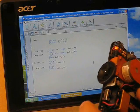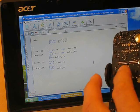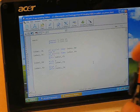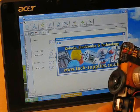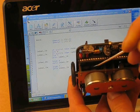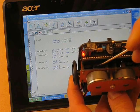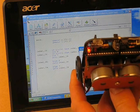Before I speed the mouse up any more, I'm going to ensure that the encoders are working as well as I possibly can, because they need to be very precise if your mouse is running a lot faster. Here is a simple program which I'm just going to load in. This allows me to turn the worms by hand. As you can see, I can turn the worm gear very slowly and ensure that half a turn puts the light on and half a turn doesn't, and the same with this one here.